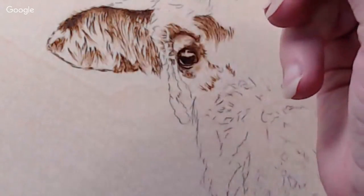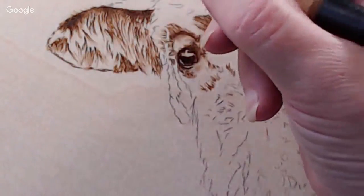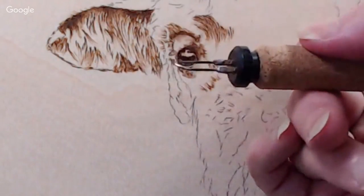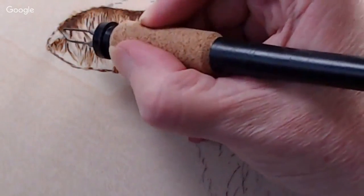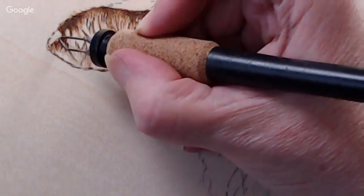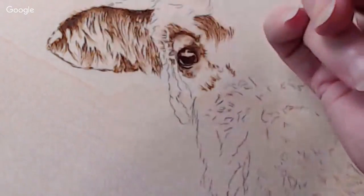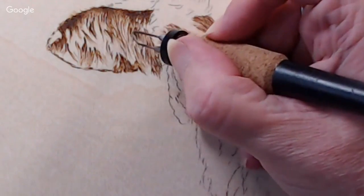I think Andrew Smith says, I think this is in regards to the stainless steel. So Colwood should know. Thank you for asking them. I use the tips that I told you about, and they seem fine. The carbon just falls off. Well, if you notice, I'm on a 4. I have no carbon buildup on my tip. I haven't wiped it at all. I didn't even wipe it before I started. I really don't have that problem of any kind of carbon buildup. Now, if I go hotter, just like everybody else, it will start dragging a little bit.